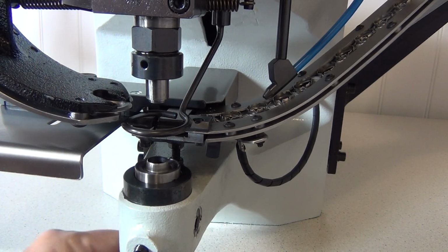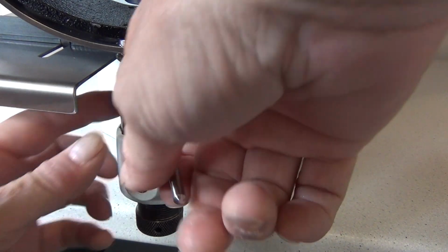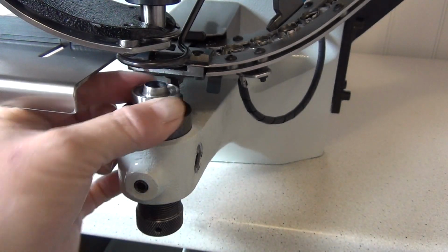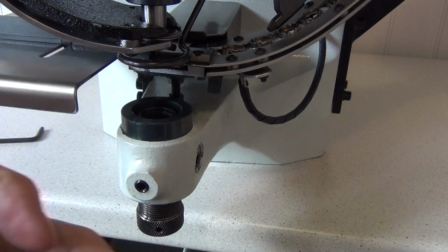To remove it, first move the holder back up. Then lock the set screw on the front of the machine. Take the puncher, insert it into one of the holes on the side of the die and loosen. We can now remove and, in a future situation, replace the bottom die if needed.